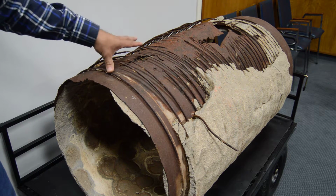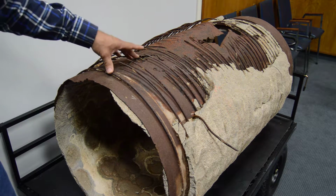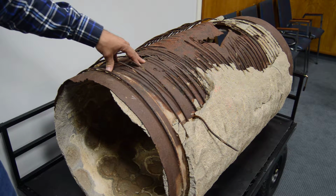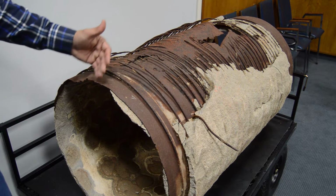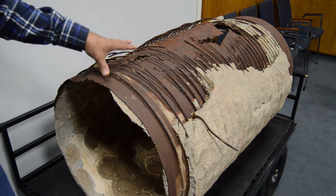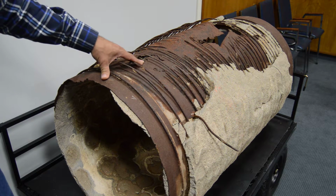Luckily, some of these ruptures have not interfered with the service of the community. We've had at least once a year a rupture where we've had to contact all the community, contact the businesses, put full-scale restrictions on our water usage just to be able to repair this line. For this line, we do call in experts from Dallas that make the run overnight, or as soon as we call them. They get on the site and we start construction. They start cutting these pieces out, welding in the repair piece, and we recoat it with concrete when it's done. So that process, if we have everything on hand, nothing goes wrong, takes almost 2 days.